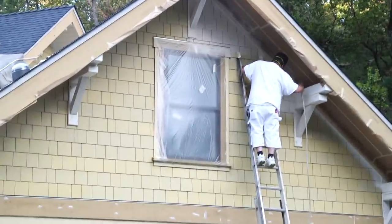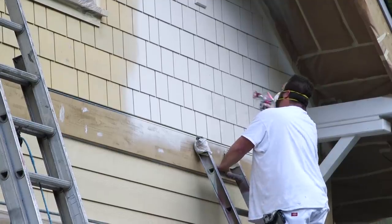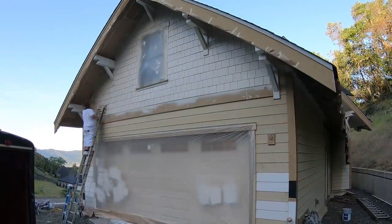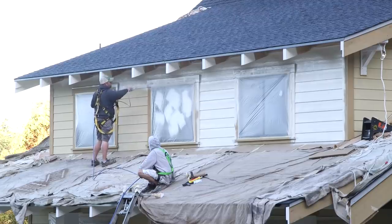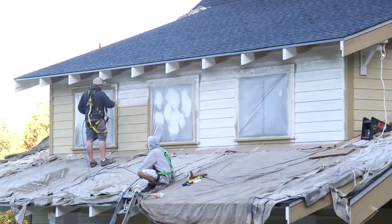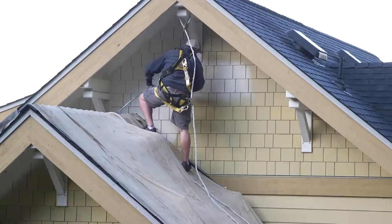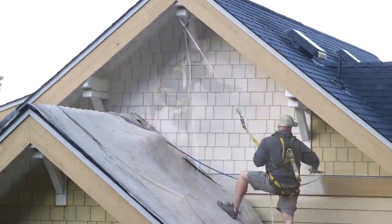Now just a word about airless paint sprayers. They are terrific, and with practice, a painter can work magic with these things, but there are some maintenance issues, and you've got to use the right tip for the job. Tips are designated with a 3-digit number. Now right here, Nick is using a 515 tip. The 5 speaks to how wide the fan of paint is when the gun is held 12 inches from the surface. And, in a very counterintuitive way, the 5 is half of the fan width.